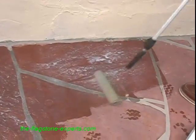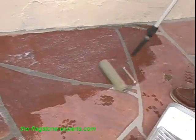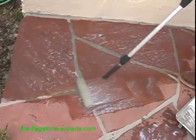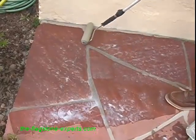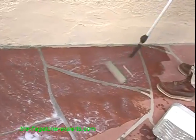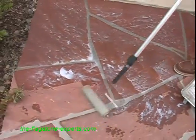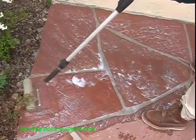Well, you don't want to do it before rain. You want to make sure you have 1 day of drying. Okay. They suggest, I think, on here 72 hours after you put it on to have it dry. Put it liberally where the joints are, because you definitely want to protect the joints. I see. And next to the house. And that helps prevent moisture, especially in the winter, from getting into the joints and then expanding and freezing and then popping the joints.